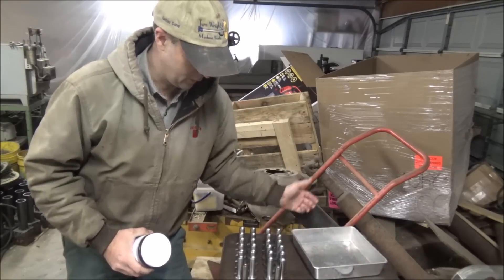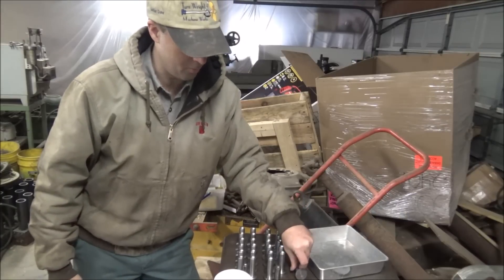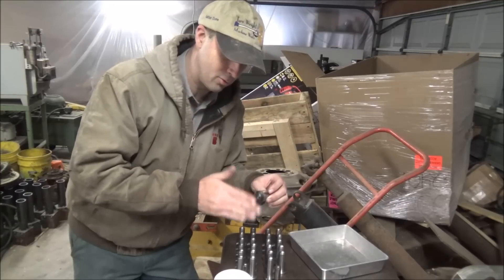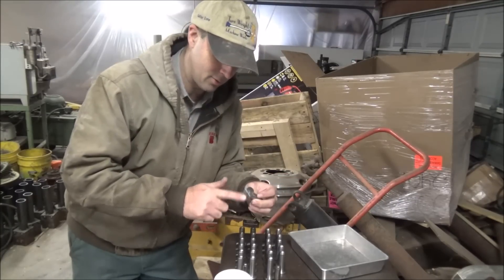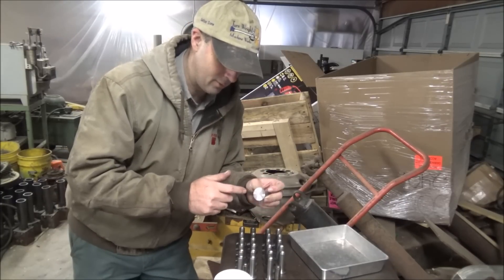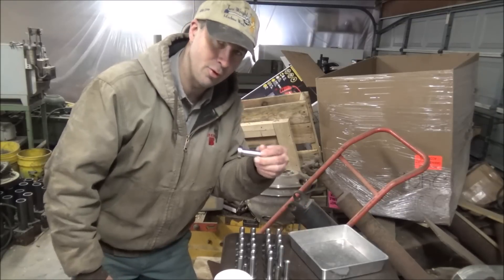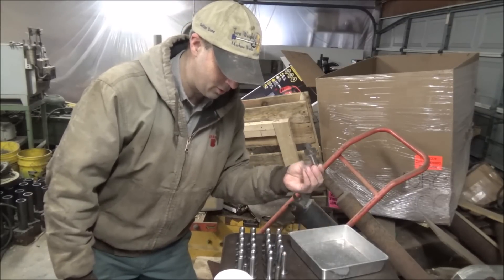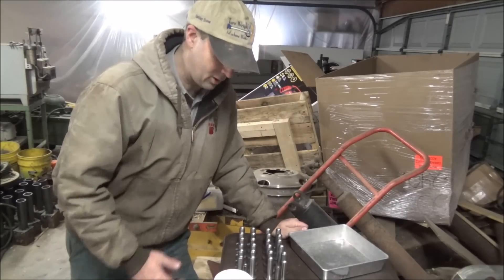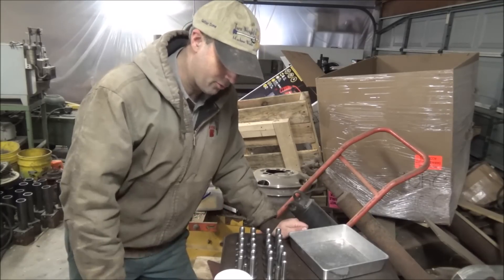I've managed to get my two sets of tappets made here — almost. One of these was a botch. When I was first doing these, I was cutting them off in the bandsaw to try and save material, but the bandsaw needs a new blade on it after cutting all those steel beams up, and it cut crooked. By the time I straightened this face up, this one's thin compared to the rest of them. So I'm one short — didn't have enough material to make another one. That's all I had out of the stick. So it just won't be two sets, but that's fine because I only got one of these sold, so the other one will just be extra. Sometime I'll make another one and I'll have a full set.